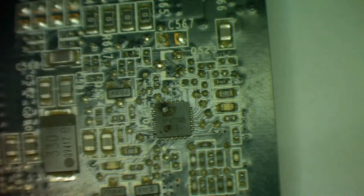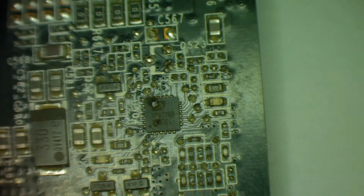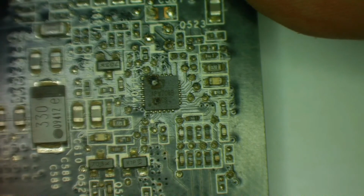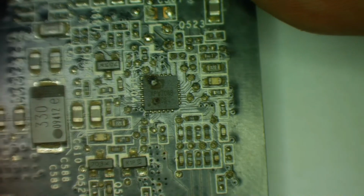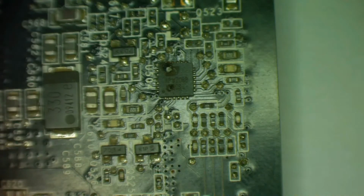The worrying thing about that is, why has it gone bang? I suspect this has gone bang because of something effectively short, because 10 ohms isn't enough to make this go bang. It can supply more than 100 milliamps, so something must have drawn considerably more power than that at some time. And I don't think the 10 ohms is right. I think it should be something like 100. I have a nasty suspicion we've got a blown GPU here.